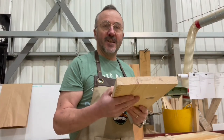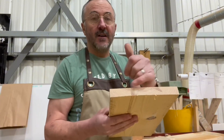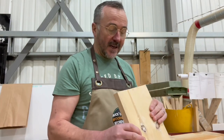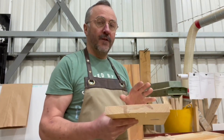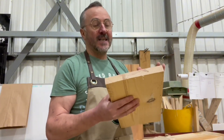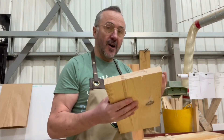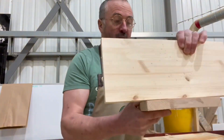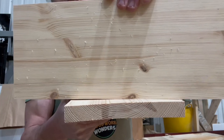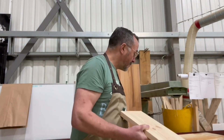This is a piece of timber that's not laminated — just a normal piece of timber that's been cut from a tree. You can see the annual rings on the end there. What happens with timber like this is it will move, because it's one solid piece. As it's a natural product, as it dries out and cures and gets used to the humidity in the room, it'll start to move. You can see that — it's not perfectly flat — and that is because it's not laminated.